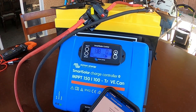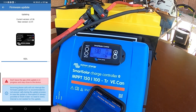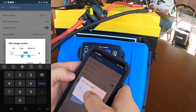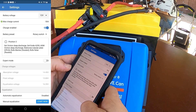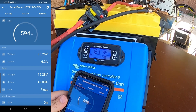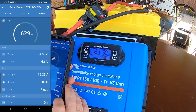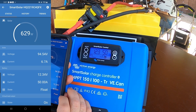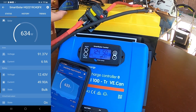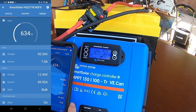I finally got paired with this thing. The default pin code is six zeros — the app will say four zeros but it's actually six zeros. Our max charge current — we'll take that down to about 50 amps. Let's connect our battery and see if we get 50 amps. 47, 48, 49, 50. We're charging with 626 watts. Battery voltage 12.33, charging with 50 amps. We're currently in float — should be bulk. There we go, we finally got bulk. So it seems to be working great.